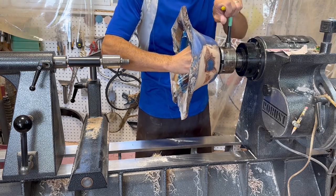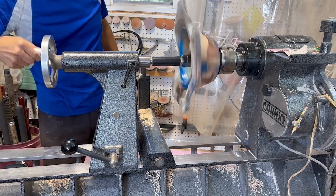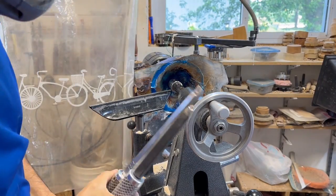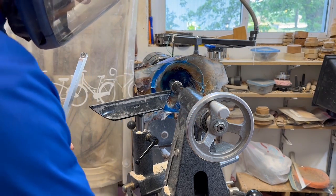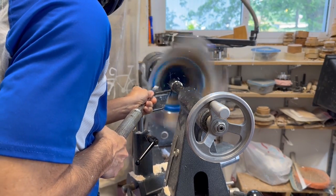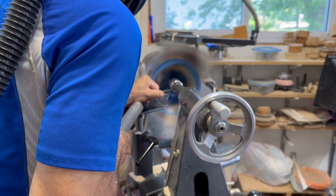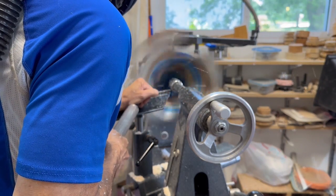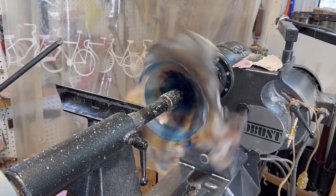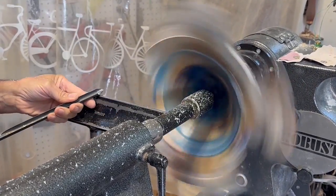Now that I've turned it around and into the chuck, I'm going to use a tailstock for extra support. I don't have a large tenon so it's a lot safer to do it this way. Here are the two tools I talked about earlier — the Hunter Hercules tool and the Easy Wood Tools — and I'm going to use a combination of them, whichever one seems to do the best job and not create too much chip out. I do like the Hunter tool a little bit better because the way the cutter is shaped you can ride the bevel and get a much better cut than with the Easy Wood Tools. Then when I have the surface the way I want it I'm finishing up with the bowl gouge to get an even better surface.